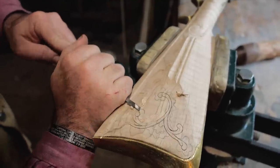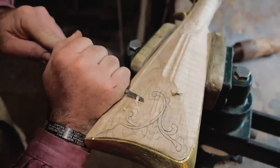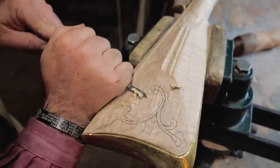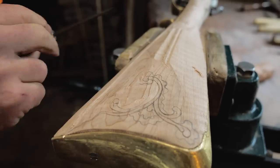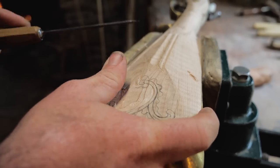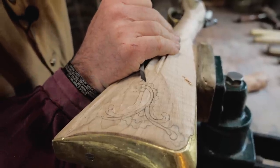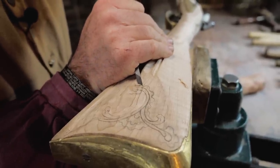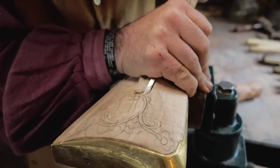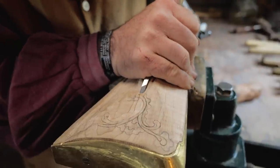This spot right here is really high, so I'm not too worried about tearing because there's a lot of wood that has to come off here anyway. When you get around this area, be careful — you don't want to get into your cheek piece or deform it too much. Going against the grain right here, you just have to be careful so it doesn't tear instead of cut. You always want cuts, not tears.